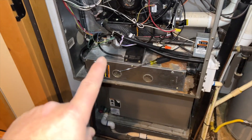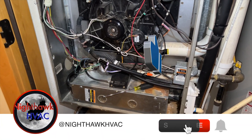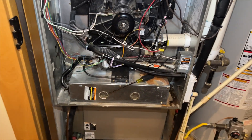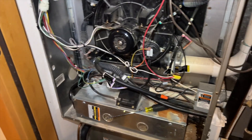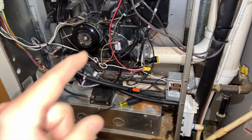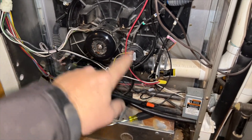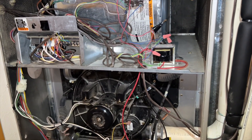We're back in the theater with this Carrier unit. There's a recall on the heat exchanger — it's completely rotted on a 90% efficiency furnace. Water is pouring out of the secondary heat exchanger and cooling off the primary, so it's just not heating at all. We're going to be changing this out. They gave me a new heat exchanger, but since it's a Carrier, we have to actually rebuild it — they only ordered the cells, so I'll have to reuse a lot of the old heat exchanger components.